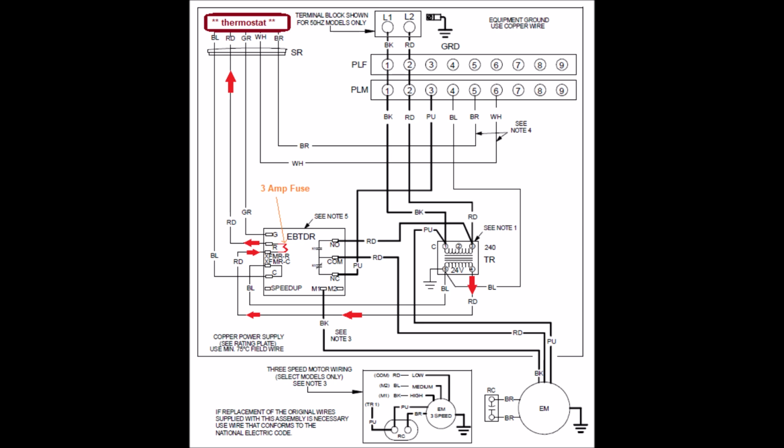It says that there's a strain relief, and that's on that top cover that I removed on the air handler just a minute ago. But this is where you would have your actual field wiring for your thermostat wires, going to your outdoor unit, to your thermostat in the hallway, whatever. All those wires are basically meant for thermostat connections, but there's one that's missing, and that's the yellow. Because this is an air handler, it has nothing to do with your outdoor unit and your contactor or your compressor, so you're not going to see it, but you can envision it here.